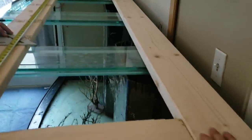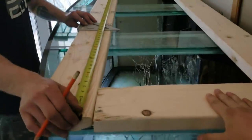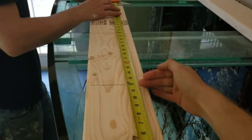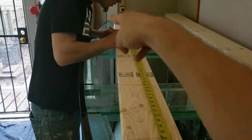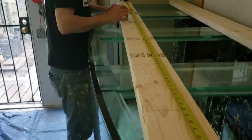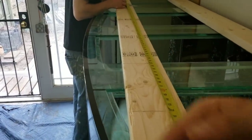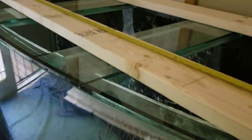Here's our plan. We're going to do a 2x6 wall down the back, center supports in the middle, and another 2x6 wall going down the whole front. We are marking them every 1 foot on center. There's going to be a 2x6 structure that's 24 inches tall, and then we have this bow which comes out another 7 inches to the front. We are going to use a 2x8, mark it, use a jigsaw to cut it out, support in between all the way down, and then screw it to this structure.